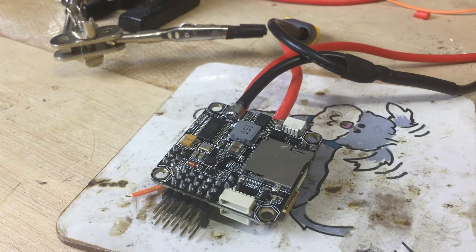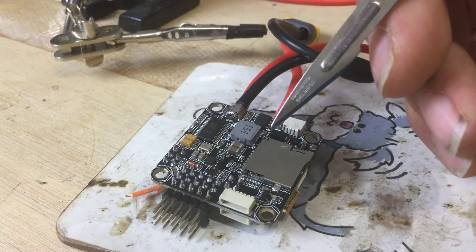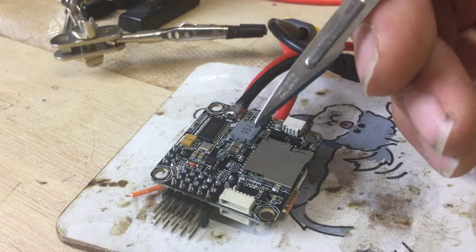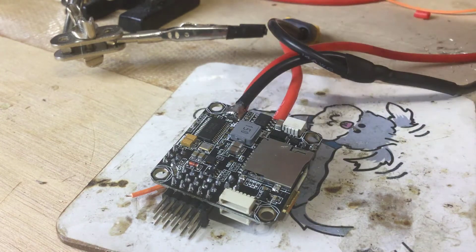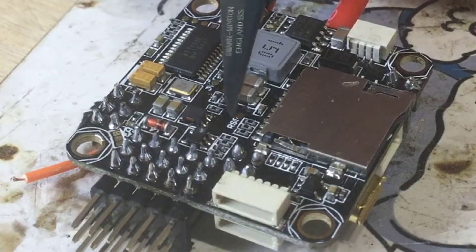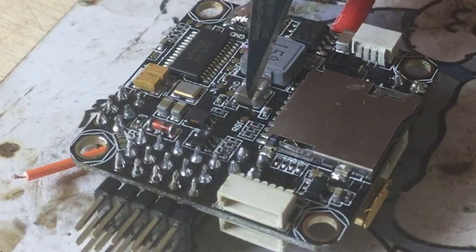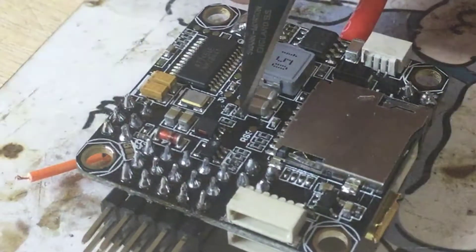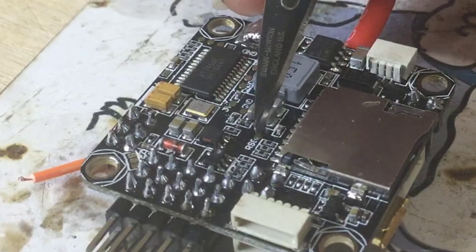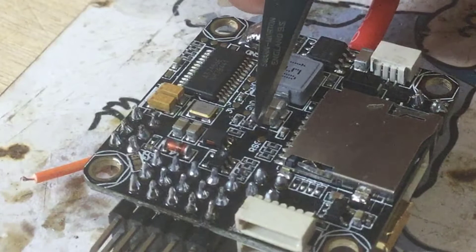There's been lots of discussion and confusion about this, and I'd like to clarify something: there is an RSSI pin or pad on the V2 board and it's hiding. On the bottom of the board you'll see it says 'RS' and something or other. If you look on the schematics, that is the RSSI pad there, and it is an absolute ball bag to do.